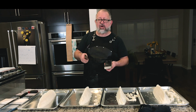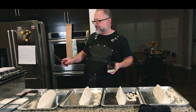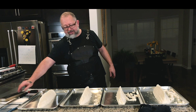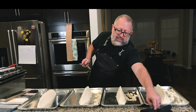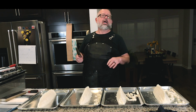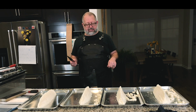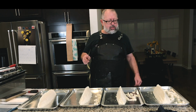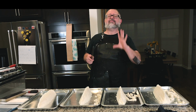We go back at the proper angle, which is the sharpening angle, and finish. In doing so, any of those little teethy pieces of metal that are sticking up will be removed. Now, if we go over here to the harder metal, this is a VG10. Obviously, some of you guys are using white number 1, super blue, ZDP 189, HAP 40, R2. There's definitely a lot of steel that is much harder. And so you had that fat base at the bottom that was a short burr, and that knife is solid.